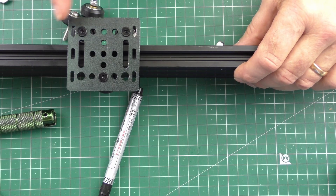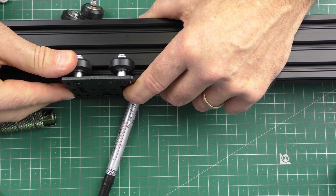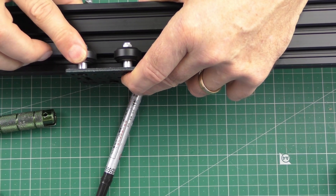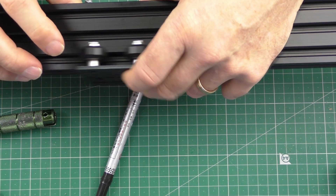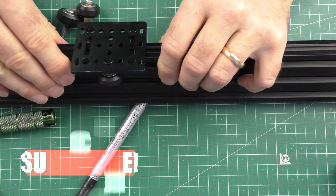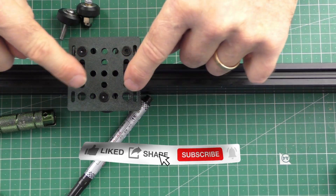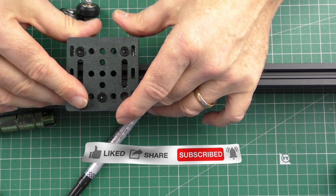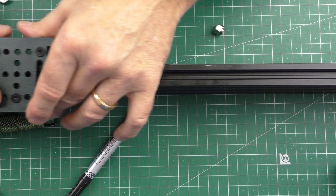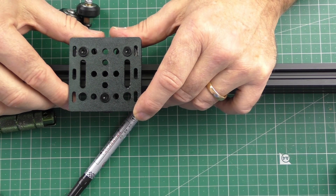It does move on its own steam and then stops. Another test I like to do when it's on the printer is what I call the slip test — I hold the carriage and I can just turn the wheel without the carriage being pulled out of my fingers. That gives me an indication of the tension across all three wheels. Here I can move the wheels without the carriage being pulled along — that's a good indication that the pressure is enough to keep the carriage from wiggling but not so tight as to give me the flat wheel syndrome.